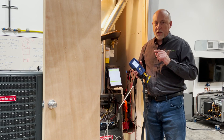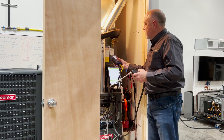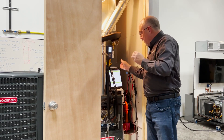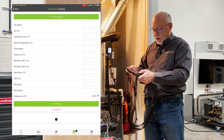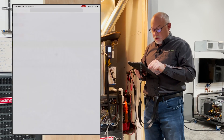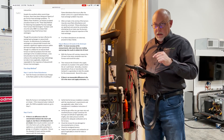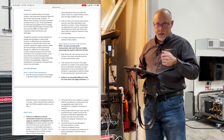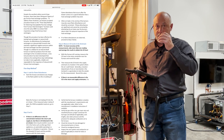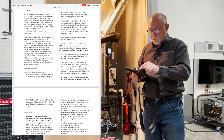It does have a full touchscreen, but once it's paired with a MeasureQuick app or with a Blue Flame app, you really don't have to use it. We've already gone through and done an initial gas clock in the meter. We've done our ambient CO where we've activated supply and return — this goes back to the induced draft heat exchanger inspection form. In the MeasureQuick app, if you tap on that, you'll see there's a five-step method. We want to look for flame disturbances, then we're looking for CO in the supply air and the return air and checking CO in the stack. If you're not using a combustion analyzer and you're servicing gas appliances, you aren't meeting industry standards — it's very important that you consider purchasing one.